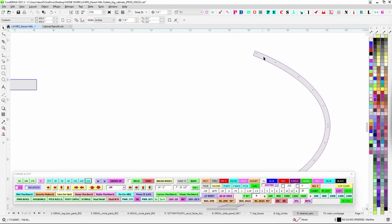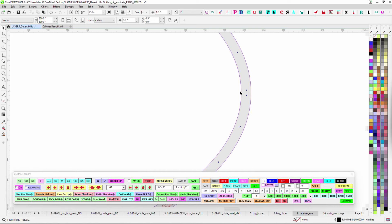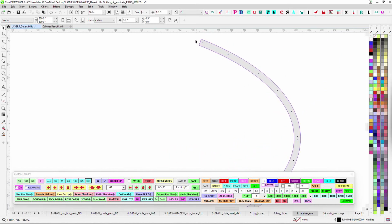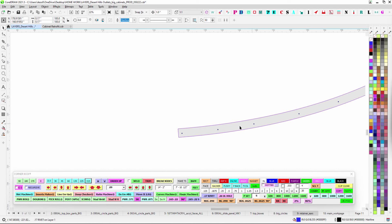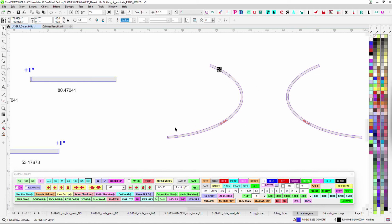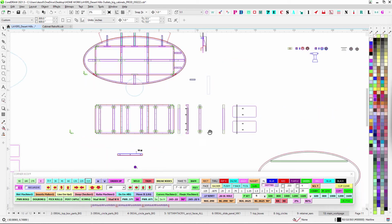And then, like I say, we're going to have 2 inches of this. When it comes time, the very last thing you're probably going to do is lords these on. You'll see that even here, this is going to help stabilize that face seam. So this is going to be a nice solution. Plus, you just lords the crud out of it. I imagine what we'll do is do a couple of flush rivets here, just to help. Maybe do these 2, and then a few rivets here, just to give that extra, because like I say, people are going to use this as a handle to carry this thing around for prep and paint and stuff. So we want to make sure that's nice and strong.